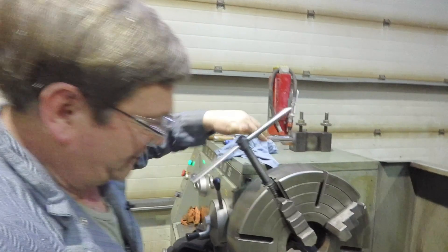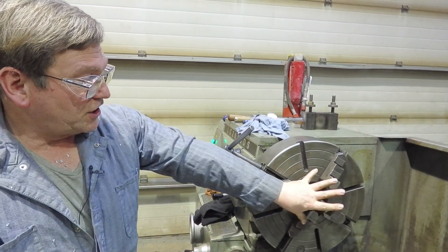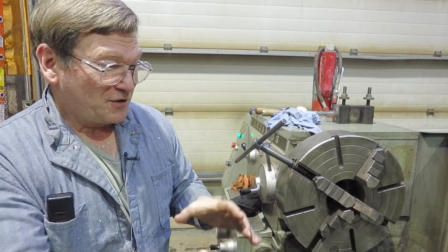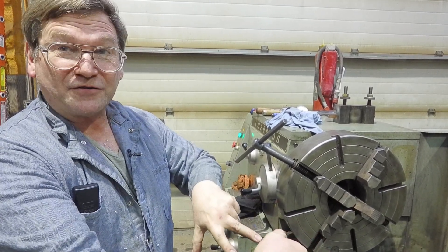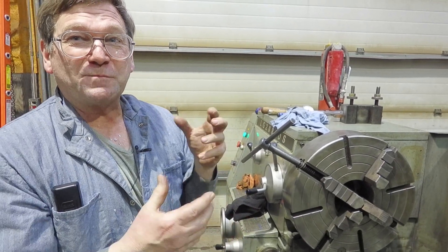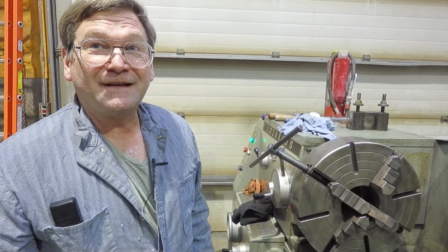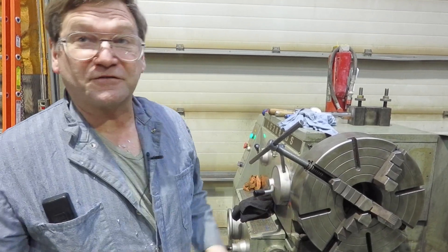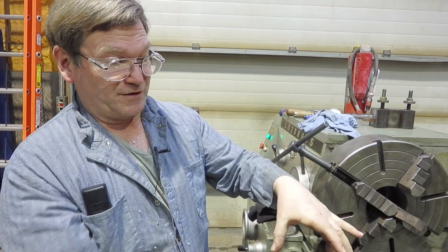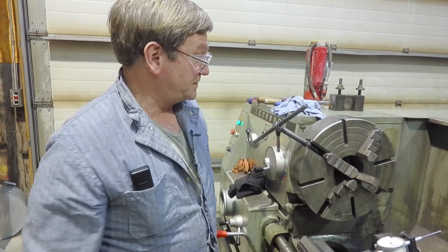All of these different chuck types have different points, but we're talking about four-jaws today mostly. What happens when you have a chuck with more than three jaws and you're chucking down on something solid: when it hits those three jaws, it's done. You've got six jaws, but it's going to pick maybe one over here—not just three on a triangle—it's going to pick the ones that get tight first, and the others stay loose. If there's any inaccuracy and everything's solid, it's only going to grab on three points. It's the fact of using it with tubing—things that bend a little bit—where it gives you extra support. If you just had three points, it would push out in between them. With six, you'll still have little bumps in between, but they're less than with just the three points.